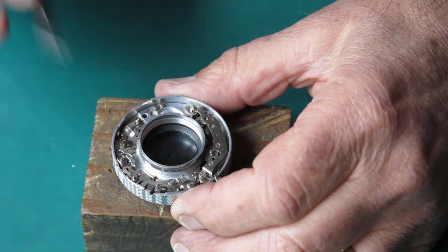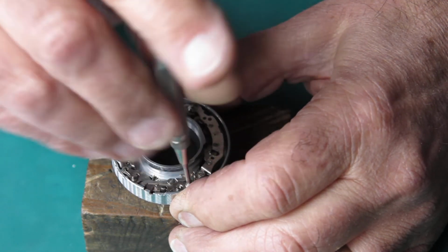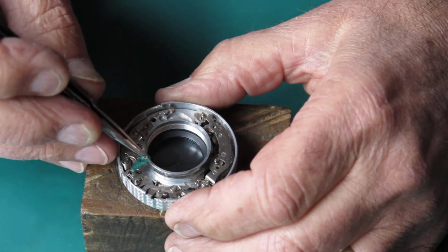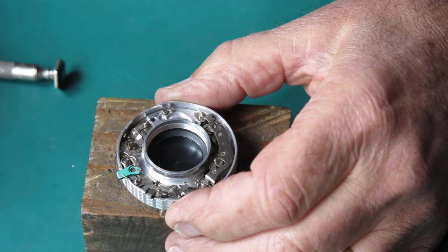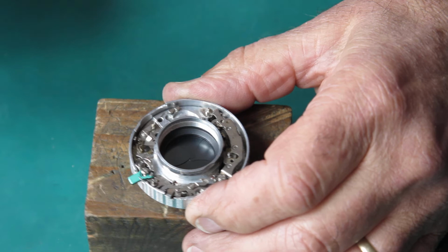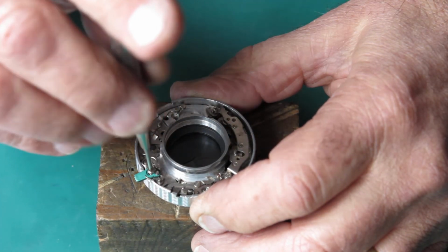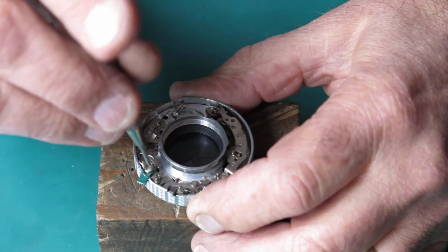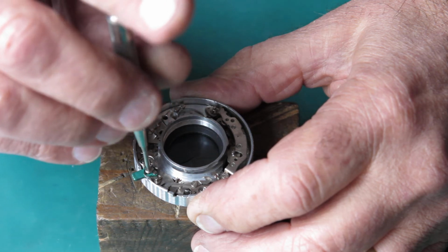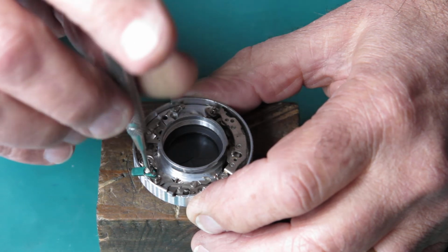The plain screw goes at this end. At the other end, got to get the XM flash sync lever in position. The shoulder screw goes through that. This is hard to get to stay there while you're trying to position things. Get that lever to seat round the screw shoulder's tricky. Yeah, it's going to do it. Yep.